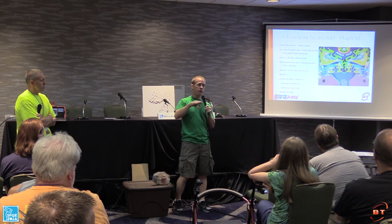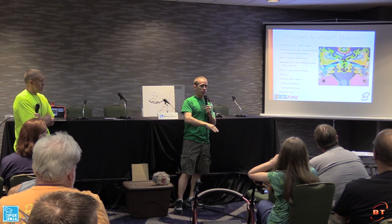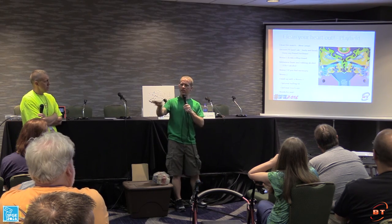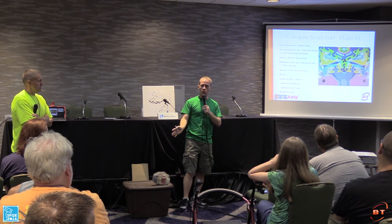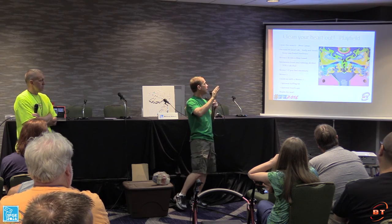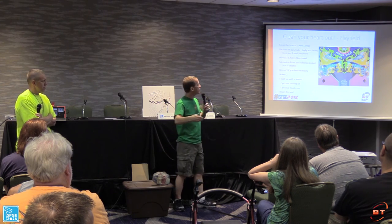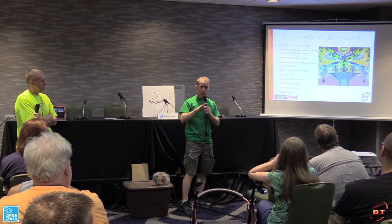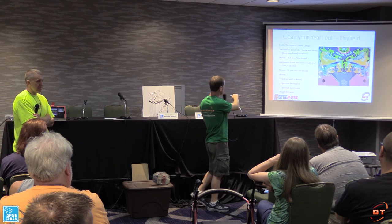Novus 3 is the hardest, deepest cut of the Novus line. So if you feel that you need to, go back over the playfield with a microfiber towel and Novus 3. Once you finish with the melamine foam, it'll be all white and hazy. That's where the foam's broken down, and some crud is still left on the playfield. We're in the process now of doing that final cleaning to get all that stuff out. If the play field's pretty rough, go at it again gently, because Novus 3 is the most aggressive.